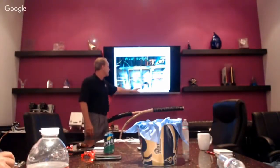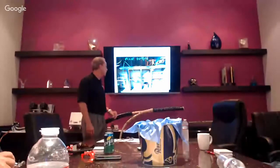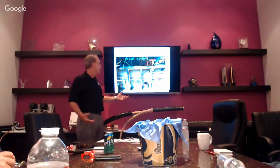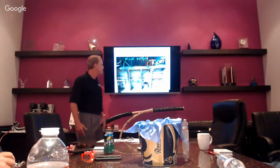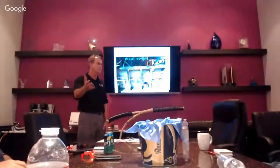There's no access through this wall. And then you got an electrical panel right where we need to start swinging up. So ultimately what happened, if you're out there early enough and you spot these things, the electrician moved his box over to here, and then they had to cut out this much of the frame, and we were able to get the job in. Those are the things you want to look at when you find the beer tower on the front bar.